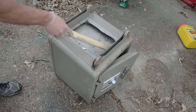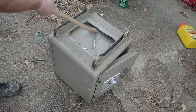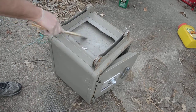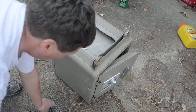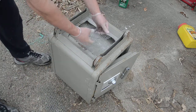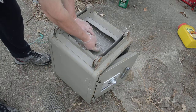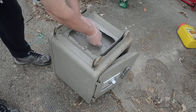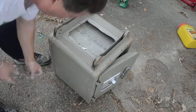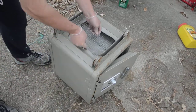It needs to move up under those edges so that I can put my mesh in there. Then I take the mesh to add reinforcement. You can use concrete rebar, you could use old spoons, knives and forks if you wanted to — anything. Just make sure you put something in there that will provide some reinforcement to that concrete.